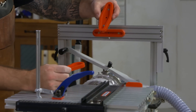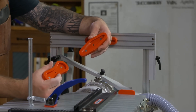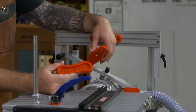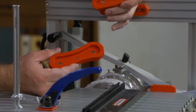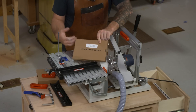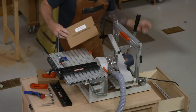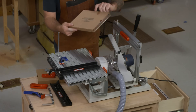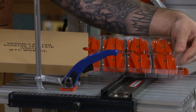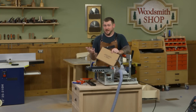There are also specialty templates: diamond-shaped templates for through mortise and tenons with a decorative end, and bow tie shaped tenon templates. We also have segmented mortise and tenon templates for mixing and matching and making your own template sizes - over 150 different combinations. There are even dovetail and box joint templates, so you can do traditional joinery beyond mortise and tenon. With different jigs and fixtures you can make in your shop, you can even do standard rabbets, dados, and grooves, acting like a horizontal router table.